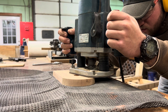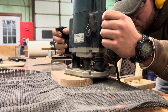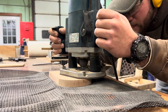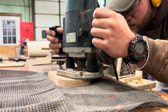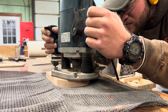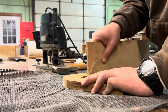Once I did the layout, I took the pieces over to the bench with the router and went ahead and just freehanded out the slot that I needed. This really turned out to not be the greatest of ideas, mainly because I don't have a lot of experience freehanding with the router. But I did come up with an idea that I think would have helped — take a dovetailing saw and slightly score that line, or even saw right to the depth that you need, right on the lines, and then just use your router with a straight cutting bit to clean out in between your saw marks. That should give you a nice even width and you wouldn't have to clean it up with a chisel, sandpaper, and a straight edge. It still worked out okay, but it could have been a more efficient process.